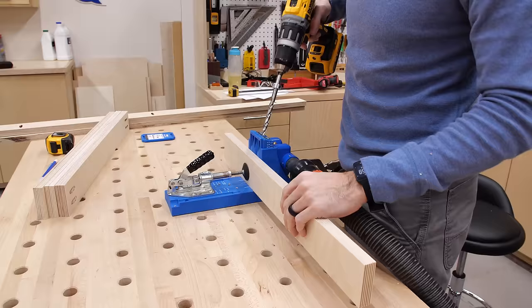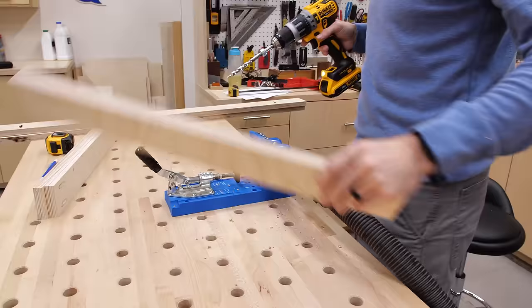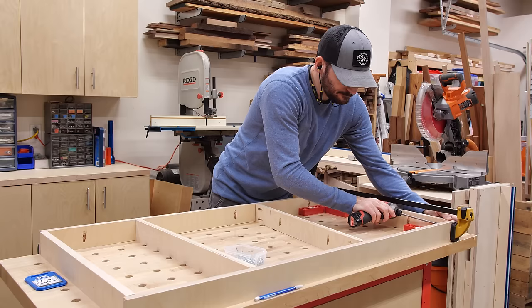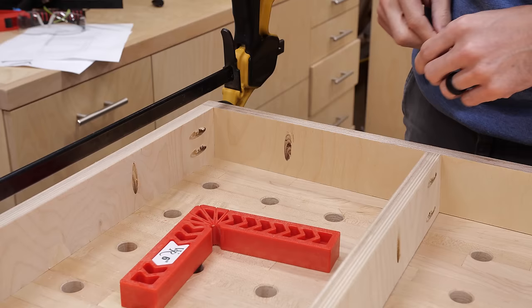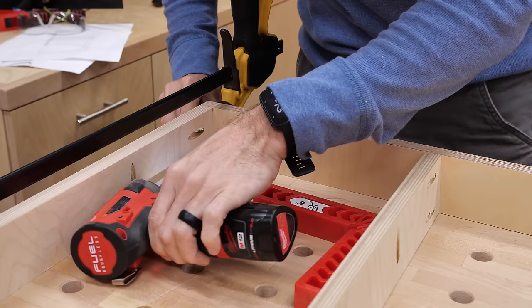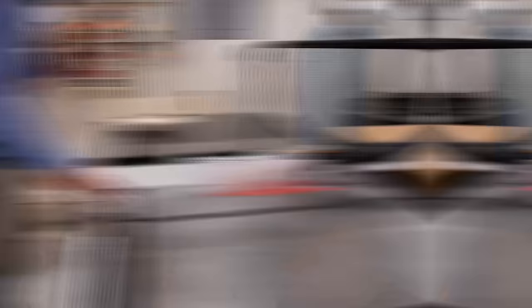The upper frame is the exact same as the lower one except I put a few vertical pocket holes along all the pieces as well. These are going to be used to attach the top to the base, while the shelf will be held in place down below with the legs and a few screws from above. A quick tip: when drilling the holes on the ends of the inner supports it's better to have them spaced a little closer together using the A and B holes on your Kreg jig versus the A and C holes. This gives your drill a little more space off the bench when securing the lower screws during assembly. Also make sure you have the vertical pocket holes facing all the same direction so that you don't have a surprise later on.